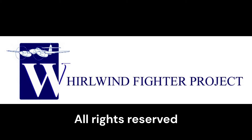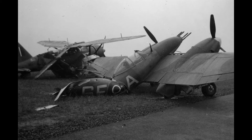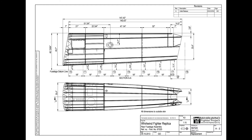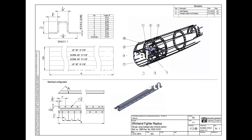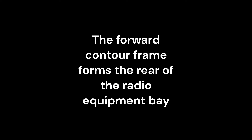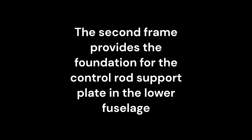The Whirlwind was the first series production aircraft that had a true monocoque fuselage structure, the form being an ogival tapering tube comprising only the outer skin, the longitudinal T-stringers, with a number of short axial intercostal channels. Where the fuselage connected to the cockpit, the transport joint skinplating required a complex doubler. There are no structural frames in the fuselage. Three lightweight frames are fitted to resist any axial shear buckling, but provide no stress continuity to the stringers, to which they are not connected.